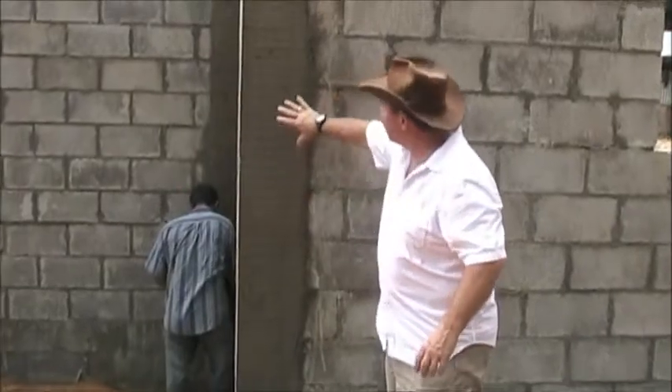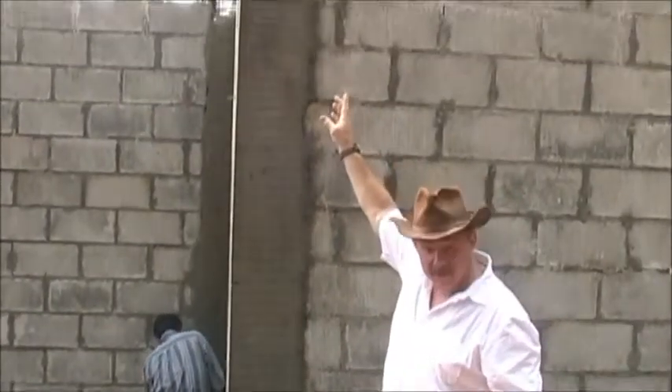Here's a complete corner post — everything's poured and we're coming up to the lateral layer at eight feet, which is going to tie the walls together at the eight-foot mark as well. This house is going to have about 11 to 12 foot ceilings on the sides and then 14 to 15 feet in the center.